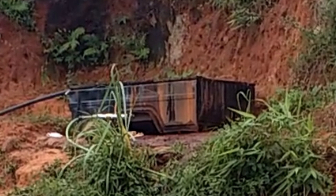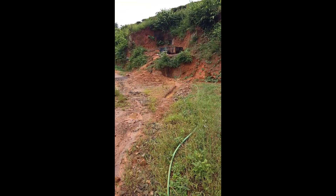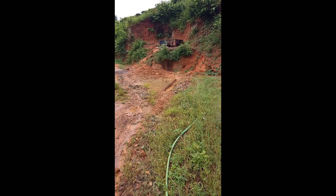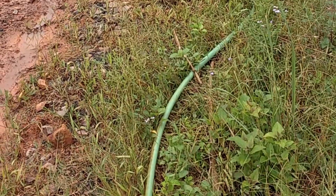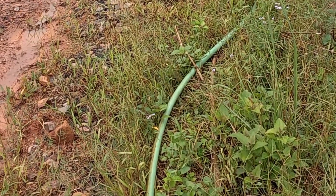This is the inlet tank with a drive pipe. It is actually made from an old Mahindra pickup tank which we have converted into the inlet tank — something quite unique. The water then flows through the reused one inch pipe to the hydraulic ram pump. I'll just zoom in and you can see the pipe shaking due to the water hammer effect, which is the principle by which the hydraulic ram pump operates.